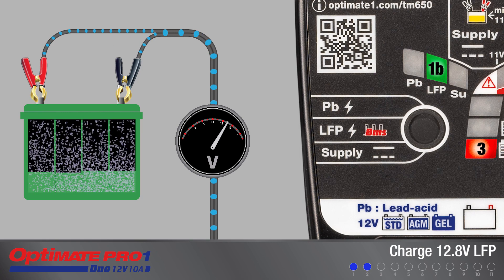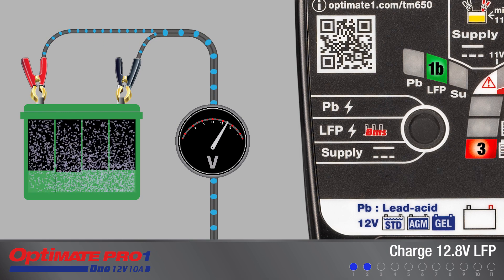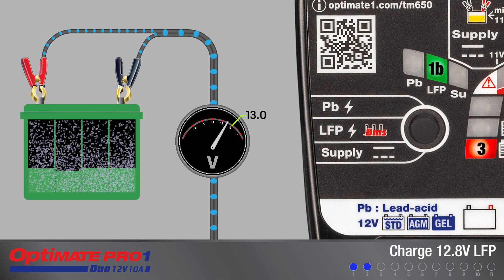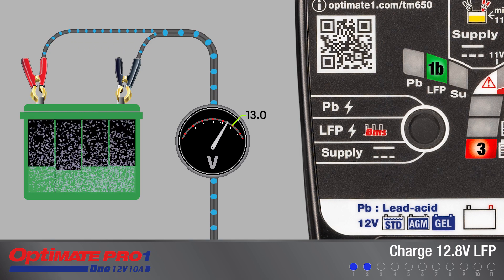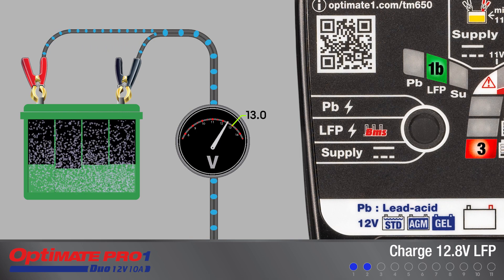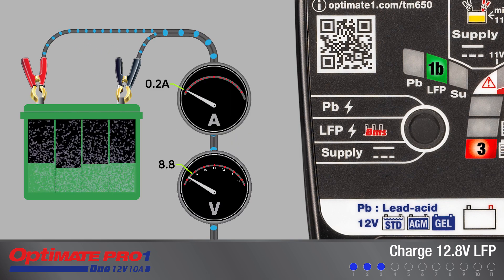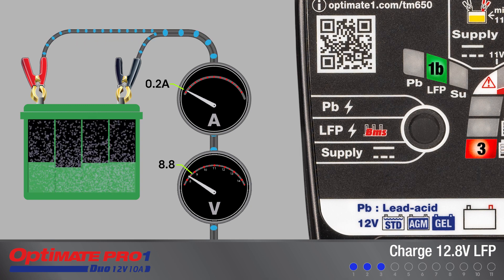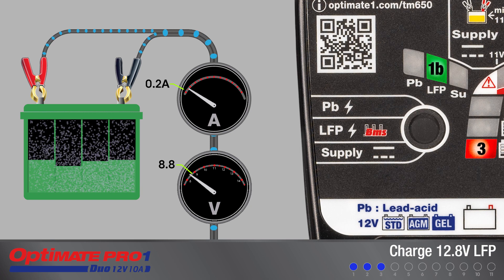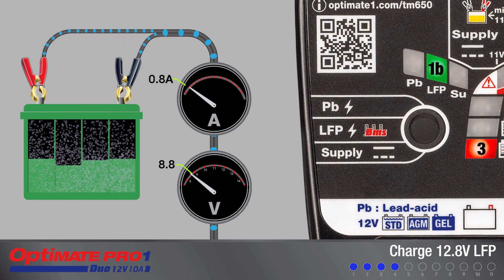Charging starts here for a battery with voltage measuring less than 13 volts, or if the charger was manually activated. Save mode continues through three steps to recover the battery so it can receive charge once more. For a deep discharge battery below 8.8 volts, low current is delivered and will increase as the voltage rises toward 8.8 volts.